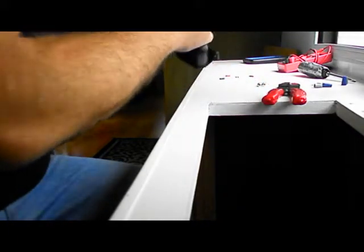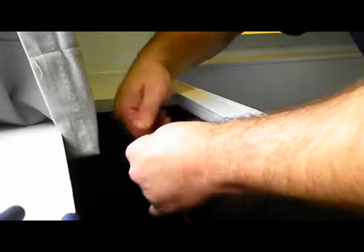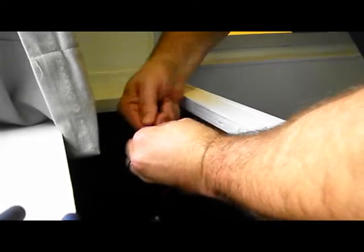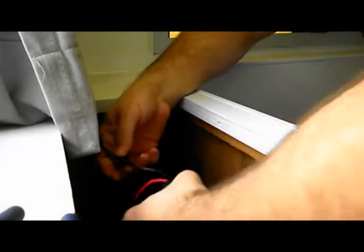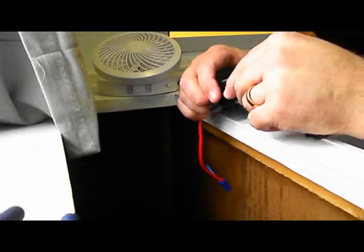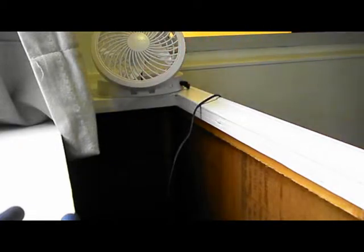We are ready to tap into our wires. What we're doing is running our hot and our ground in line, putting our wire nuts on to cover. I think we're going with the blue ones — the gray ones were just a little too small. Finger tight, not too much, or they'll spin right out and rip apart. Our ground is here, and now we should have a fan. We went and turned our power back on, so now we'll see if it works... Nope.